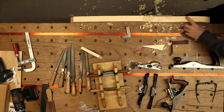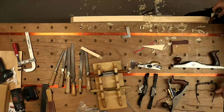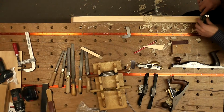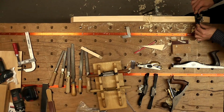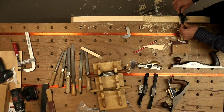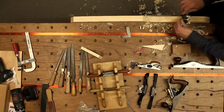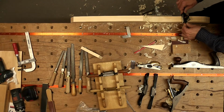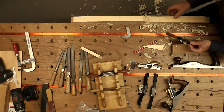Again, fingertips are telling me what's happening here, how the contour is changing, where the bandsaw cut is. I've got a little mark there. Position, sit flat. A little bit of angle, so I tilt, push along. So even before I've started to cut with this, I've got the position, make sure I'm sat nicely. I can find the cut, follow in.